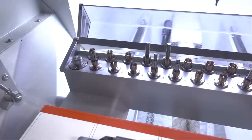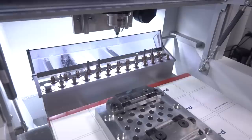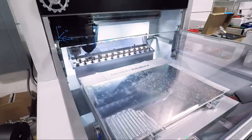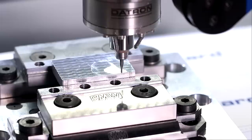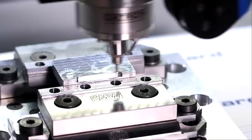The whole tool changer setup is totally different. It includes a 24-station tool changer. The cover is up right now, but if we jog forward in Y you'll see it closes to protect it from chips. It touches off tools each time it does a tool change, which also gives you the benefit of built-in break detection. They use an MQL system with — they say alcohol — we're actually using denatured ethanol, which is really nice because there's no coolant and no mess left behind. It's sacrificial, so as soon as you push the coolant through it evaporates. It was a lot of paperwork to get our first drum of denatured ethanol, but it was actually only about $400 and that will last a really long time.